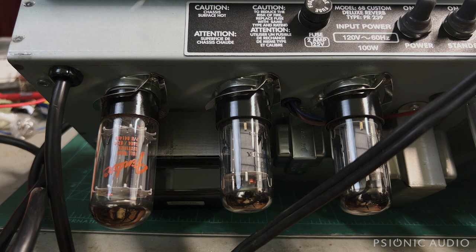One reason I don't want to start probing everything is that I have a lot of amps in progress right now, and this is going to be a free repair if repair is needed. The owner had me do quite a bit of work previously, so my inclination is that on a first follow-up, if it's just the tube, I change it out, make sure the bias is good, and make sure everything's fine — no charge. I'd prefer not to have too much time in a free amp. So far I'm not hearing any problem; I'll just let it run, because the worst case is it blows a 50-cent fuse.